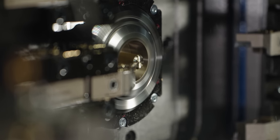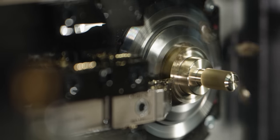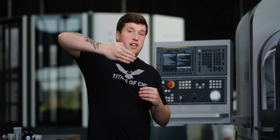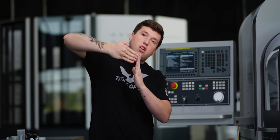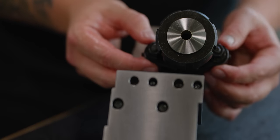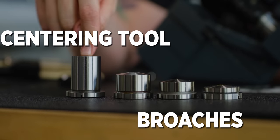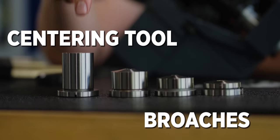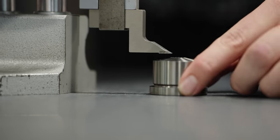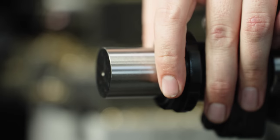All right, so as far as setting up a rotary broach goes, it's actually pretty simple. The most important thing is that your tool's on center. So I just told you that your tool's at a little bit of an angle. Now, let's say if this was center, right? If you put a longer tool in there, you're gonna progressively get further and further off center. So some rotary broach tool holders are made to be adjustable. So if you look at this external holder I have here, you can see that they gave me a special tool that's meant for centering alone. And how you center this is, you simply measure your broach's height and you scribe a line on the centering tool. You then put that in your machine and you indicate it in.